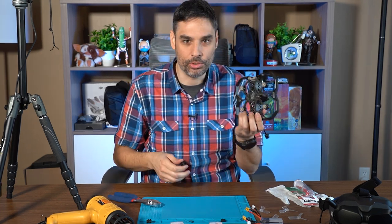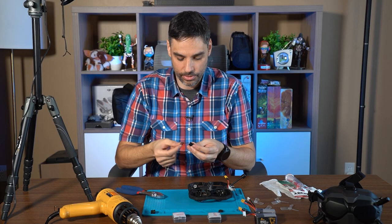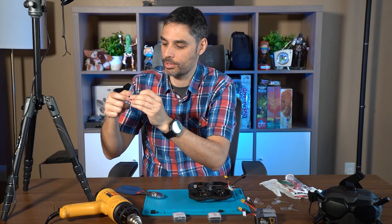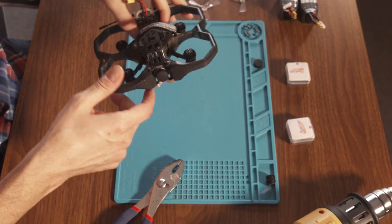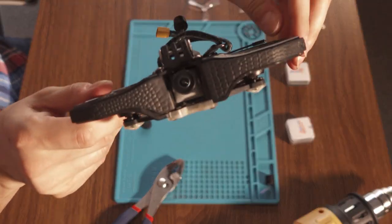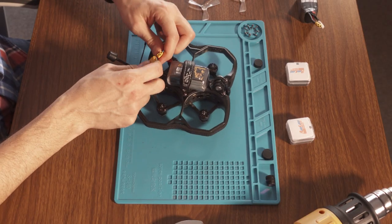Now I'm gonna put the old one to the right and the new one I can touch with my bare fingers — not the old one because it's still hot. The frame is hot too, so be careful. I'll hold it from the back and screw the new lens into the slot. This is the focus ring, so we're gonna put the focus ring in and screw it all the way in. Then we screw it into the Caddx Vista inlet, but we need to remove the lens cap in order to see something with the goggles. Look at that beautiful new lens!